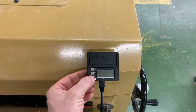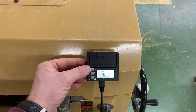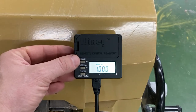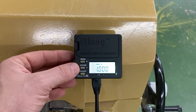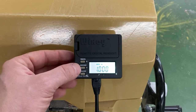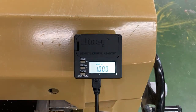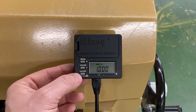This is the digital readout. It looks to me like it's backlit a little bit. It does give you some options — millimeters or inches; here in the United States we continue to use inches. Right now I have it on the absolute thickness setting, however if I wanted to change it to incremental I would be able to take off a quarter of an inch or a sixteenth of an inch or whatnot. This button is your on/off switch but it's also your calibration button.